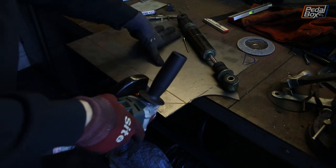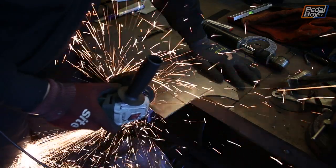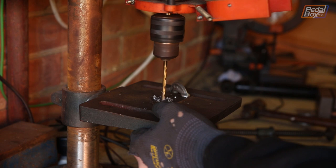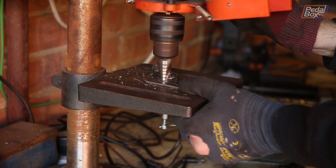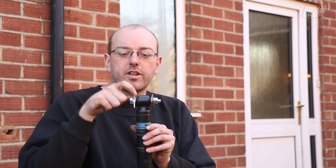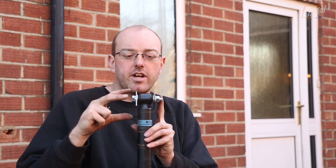For the brackets, we're using three millimetre steel because we want these to be fairly strong. We've marked out two and a half inch squares, then cut triangles out of each one. For consistency, we're drilling these out to 12mm, although the shocks are currently mounted for half inch — we'll make sure we get these re-sleeved before we finally mount them. The brackets are being mounted onto the shocks with misalignment washers, which are tapered so they miss the bushes, avoiding pinching and making them easy to get in and out once mounted.